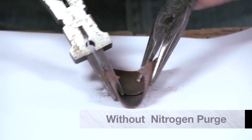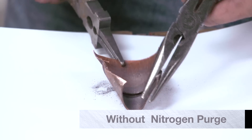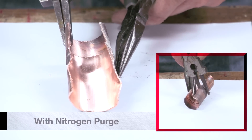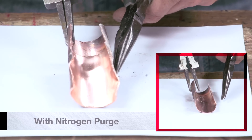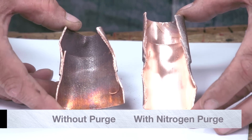There's been several incidences where the carbon will clog up the metering device itself. The tiny flakes going through the orifice inside the refrigeration system get clogged up in the metering device and make it fail. That's just one example of the contaminant inside the refrigeration system, such as carbon.